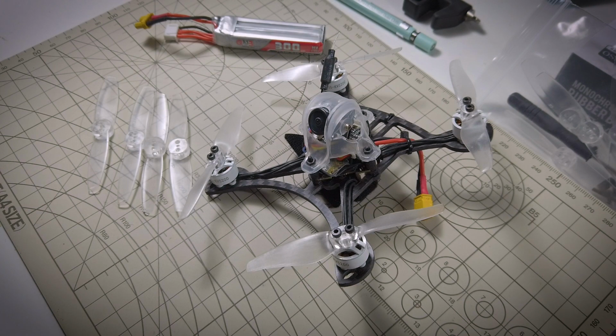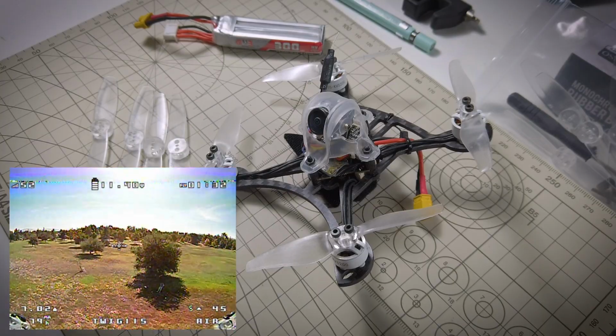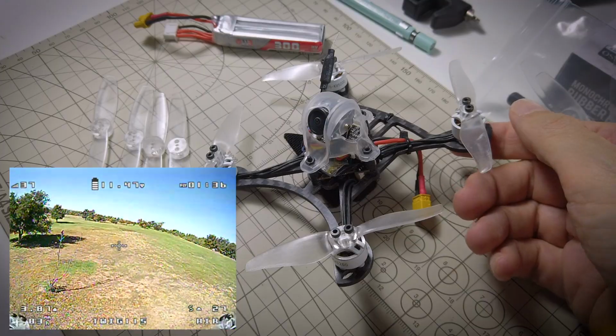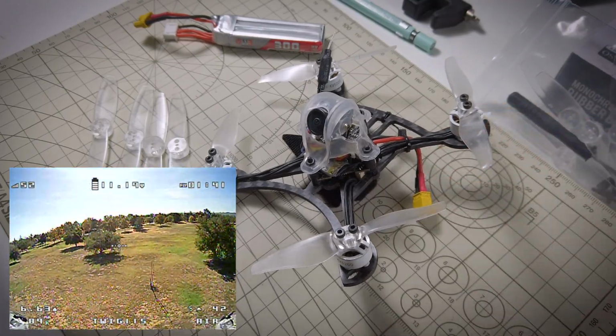Okay, so it's a few days later. Very first test flight of this, I had a couple of issues arise for me. First one was that the built-in FrSky receiver seemed to have, for me, pretty poor range, even compared to the V2 version, which I had flown before and still fly on the Sailfly. I don't fly very far, but on that I never had any RSSI warnings, or any fail-safes. But on this one, as soon as I would go behind myself for even a little bit far away, I got very low RSSI and even a couple of fail-safes.